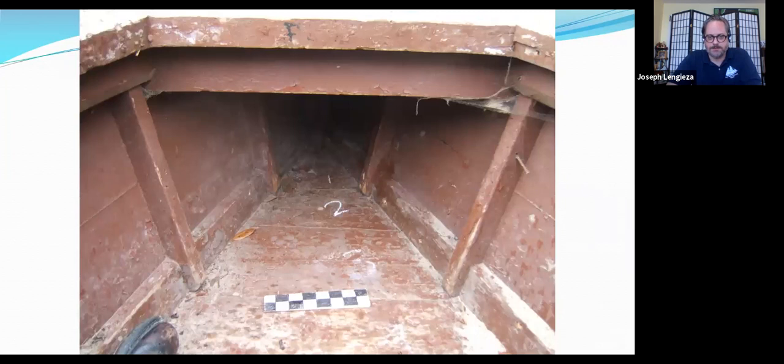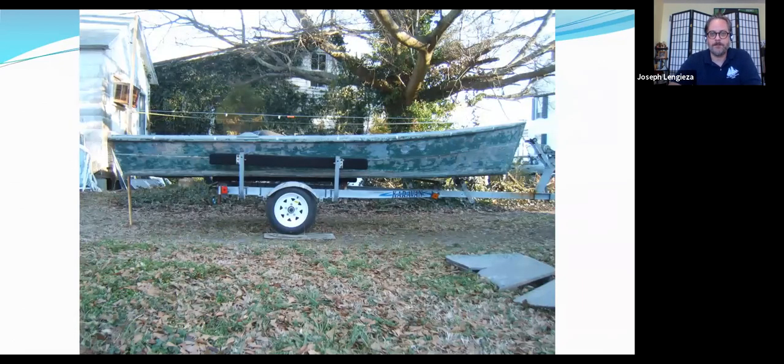And the bottom of these is just planked dead across. So just like your hardwood floors, basically, these are planks that go athwart ships, so on the short axis, and just all the way back one by one. Here's another example. This is vessel 79, I think. You can see it's got a little more shear. On this, you can clearly see that there are two strakes. So two planks going all the way from the bow to the stern, typically a 12-inch plank on these.